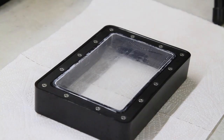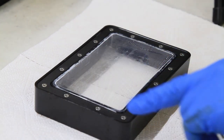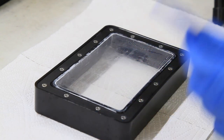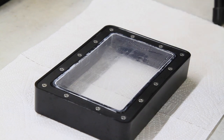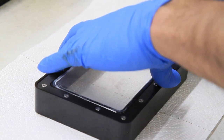Let's start replacing the FEP by first taking out the old one. In all transparency, I have never done this before, so I am learning as you are observing. The body is made of plastic, so don't use power tools. Get a 2mm Allen key — these are metric, 2mm, roughly equivalent to 5/64ths — and take all the screws loose by hand. Start with the Allen key to break the initial resistance, then you can finish with a screwdriver.